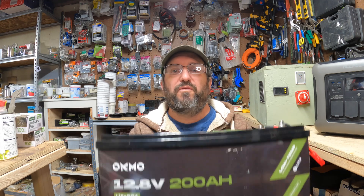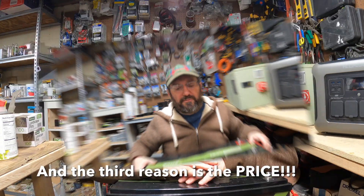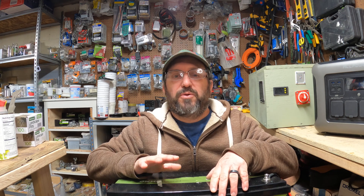This is a 12 volt 200 amp hour LiFePO4 battery, and this is what we're going to use to store our energy. I chose this one for three main reasons. First, it's big so we'll be able to store a lot of energy. Second, this battery is completely protected — it's got low temperature protection because lithium iron phosphate can't be charged when it's freezing out, plus all kinds of other protection. It's a really well protected battery. But if you're on an extreme budget you could use any kind of battery — even a little battery from Harbor Freight. We're building a 12 volt system so it will have to be a 12 volt battery, but get the battery that you can afford.